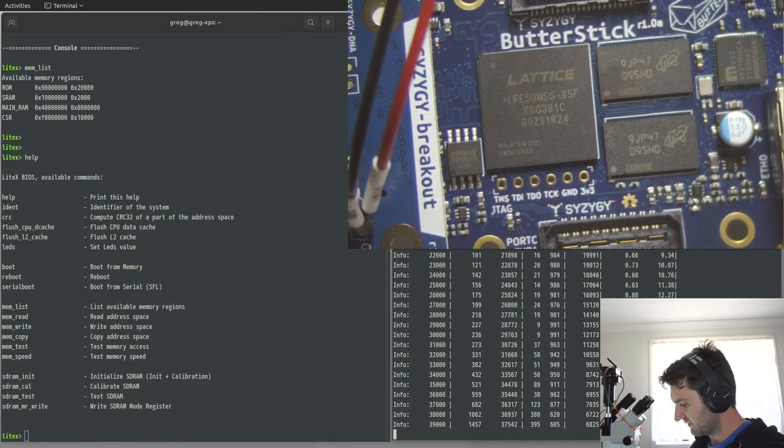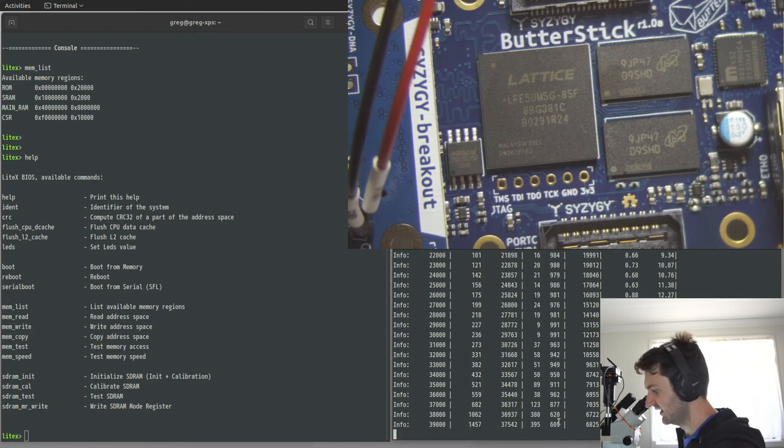So it's kind of held up on a couple of these routes here, I think. But it should clear. Often the SoC and DRAM controller stuff that's loaded into the FPGA ends up with quite a lot of tightly packed cells, and that's why it's taking so long. It's just the last couple of steps, where it has to route wires between different cells in the FPGA, and it can't fit them with the existing wires that it's run, so it has to rip up old wires and rerun them.